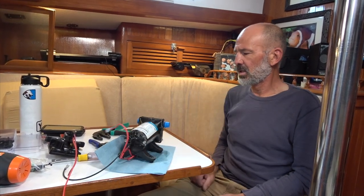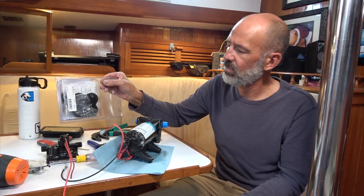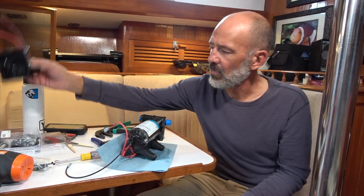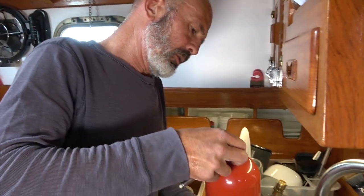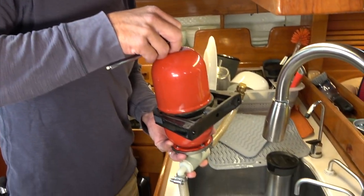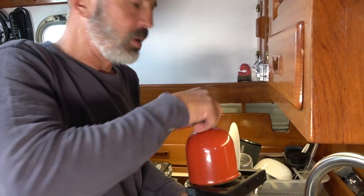This thing is basically ready to put back in and give it a test drive. If we end up having to dip into the spare parts for the diaphragm that goes between the pump and the head, then we'll take it all apart. I'm trying to get all the water out of the expansion tank, but I think it's entered into the air chamber. At some point the bladder tank had ruptured. So the water and the air seem to be sharing and co-mingling together, where they shouldn't be — they're supposed to be separated by a rubber diaphragm.